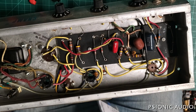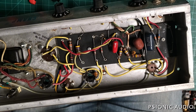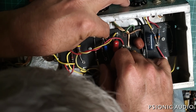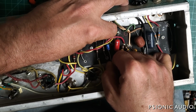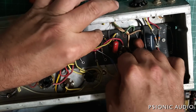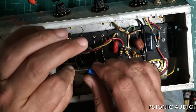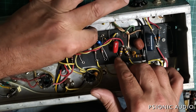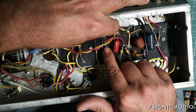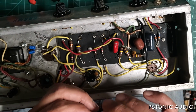All right, got these little Vishay 22 microfarad 63 volt caps I love. Seriously overrated in pretty much every criteria for the purpose here. Not expensive. They're only rated for 85 degrees, but that's 85 degrees at 63 volts, and there's not going to be either of those factors present in any of these uses. In other amps, I will go with 105 or even 125 degree rated caps. Those tend to cost a good bit more, but where that's overkill, if I've got to put 6 caps in an amp, and I can either use $6.50 caps or 6 $4 caps, whatever gets the right amount of quality and reliability for the least amount of money is good.